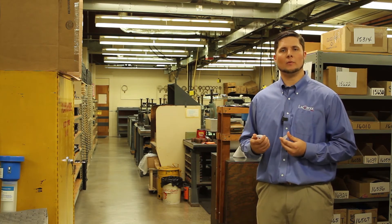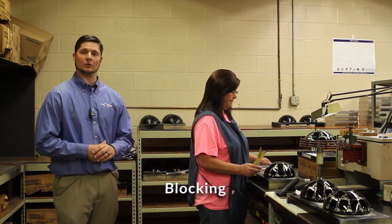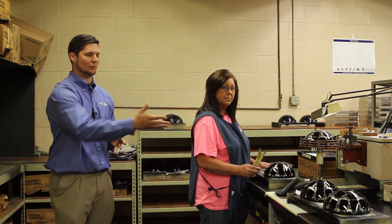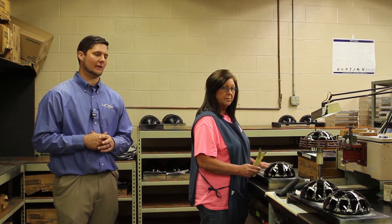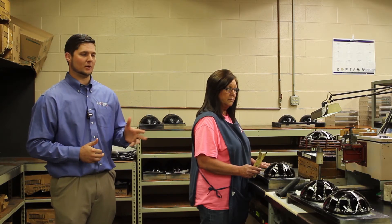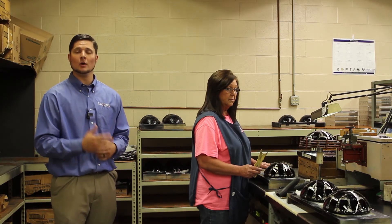When scaling up in volume, we really try to help lower your cost. Our first step in the conventional process for spherical radii is to get parts on a tool — the most efficient way to run spherical optics, treating the radius as a continuous radius and loading multiple parts per tool. We can make these tools in-house at LaCroix, whether spot tools or against-the-iron tools, using a variety of methods depending on geometry and volume. Ms. K is going to block the parts on the tool and deblock them — we tend to do that in one operation once we have continuous flow of volume production.